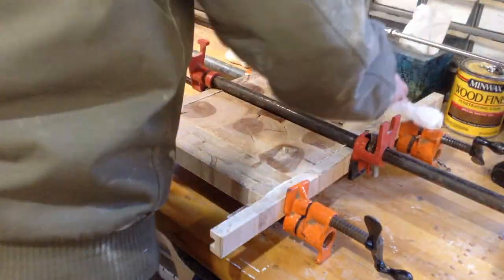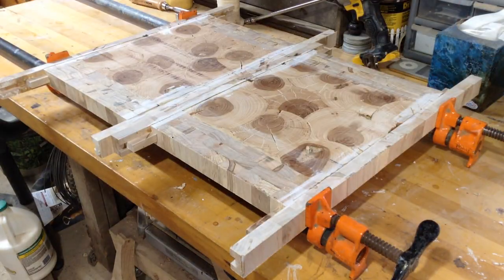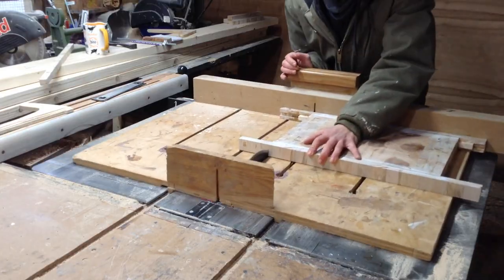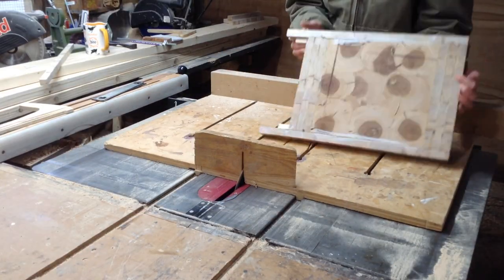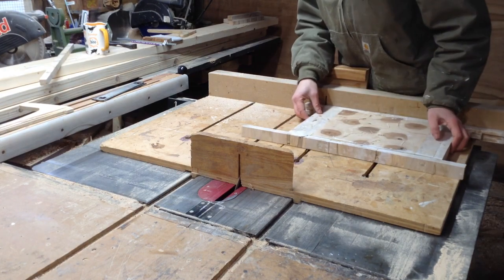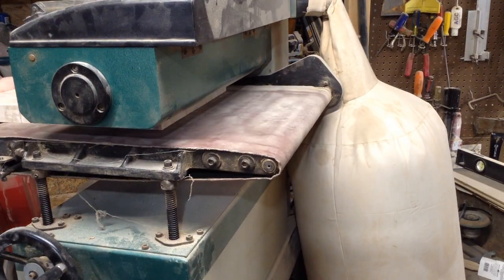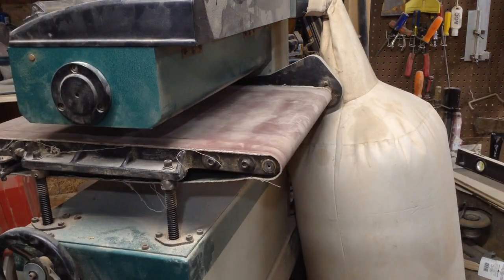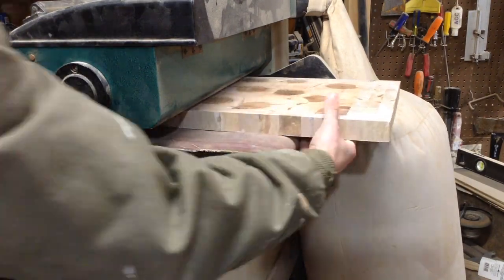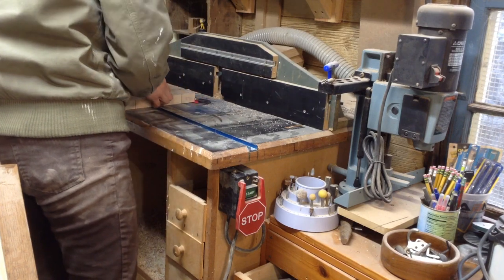I glued up one of these separately because it was taking a little longer to align all the pieces — I wanted to make sure the glue didn't set up before I could glue all three. I clamped that one in place, switched to the other two, and glued all three at once. You can see the other two glued up with that strip in the center holding the joint together and the two edges. To clean these up I'm using a drum sander I got in the spring — I haven't actually used it yet; when I got it, it needed some tweaking and I did that, but it's still not running perfectly. It was definitely a time saver — everyone who has one says they're magical machines — but it needs a little more work to run a bit better.